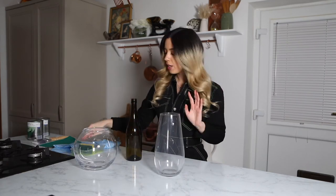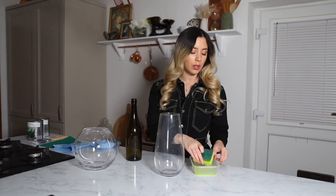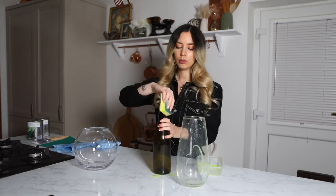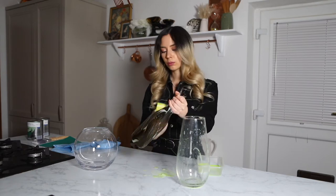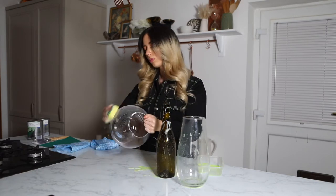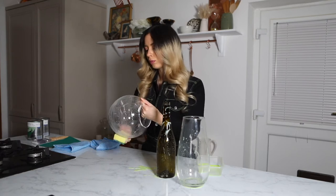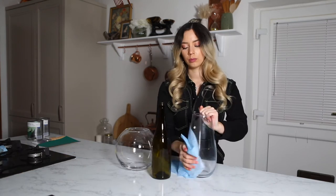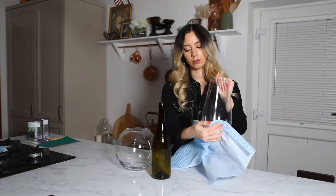We want to make sure it's all ready for painting. So the first step is cleaning with a sugar soap solution. I'm just going to use a sponge and give this a once over — this will make sure there is no grease, no grime, so when we come to painting there'll be nothing getting in the way. With a damp cloth, wipe it down, rinsing it out, wipe down until it's nice and clean, then simply dry and we'll go on to the next step.